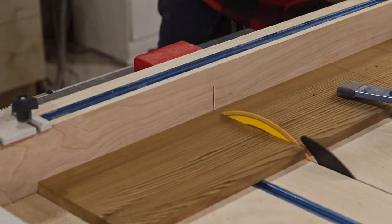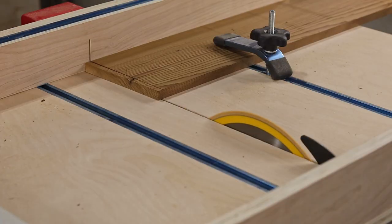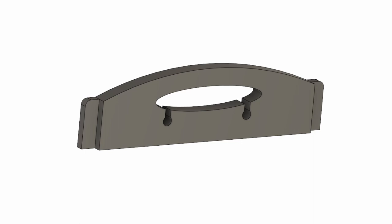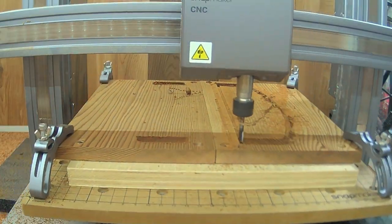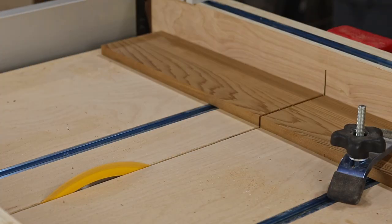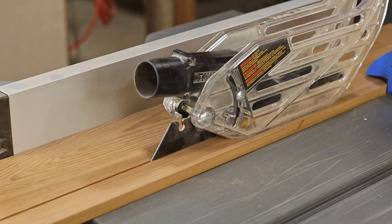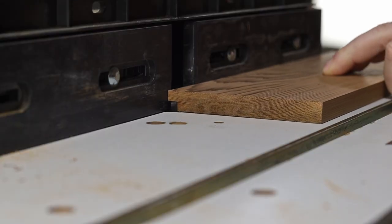These boards also have nail holes in them, so I'm going to have to work around those holes when I cut out the pieces I need for the end of the tray. The two ends of the tray are the ones that have all the curves and circles in them, so the easiest way to cut them out is with the Snapmaker CNC. And while that's running on the CNC, I can cut out the pieces for the bottom of the tray. I have to work around the nail holes on the cross-cut sled. For the bottom, I'm going to use two pieces joined together with a half-lap joint, so I have to rip them to width on the table saw before I set up the router and cut a half-lap on both pieces.